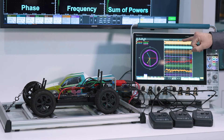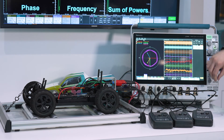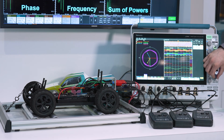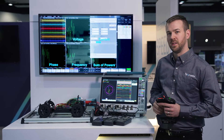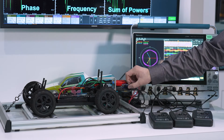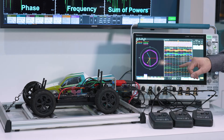The top section in yellow, orange, and red is our three voltage signals overlaid on top of each other — we can zoom in and see that right here. The next is our three current phases A, B, and C from those Rogowski coils. And then we have the D, the Q, and the DQ0 math being shown below.